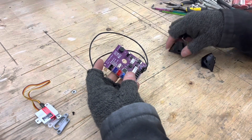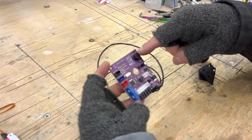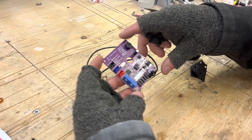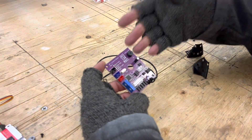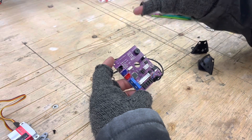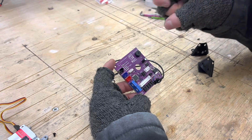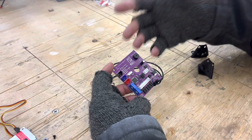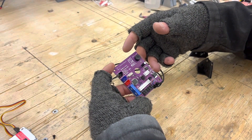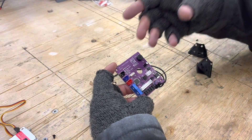The main change is the servo alarm — the buzzer up in the top right hand corner here — that will let you know audibly whether or not your servos are being overstressed. The alarm will go off probably for a minute or two before any damage actually starts occurring to the servo. What will happen is that the servo is drawing too much current and will eventually burn out, but this just lets you know that it's starting to draw too much current.